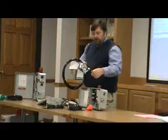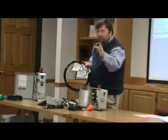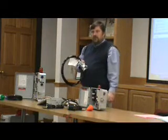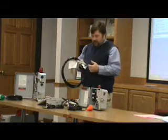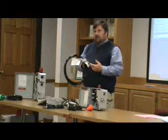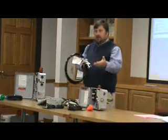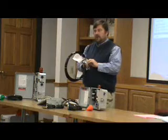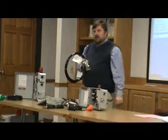If you're having a lot of problems with grease, float switches will fill up with grease, and I've seen them so heavy that they won't even tip up in the water from grease. But this has its problems too. If something happens to hit the bottom of the strain gauge and mar it, this device won't work. If you have a lot of sediment in your tank and this is sitting in the bottom of the tank, the sediment will stop this from working because it won't see the pressure change.